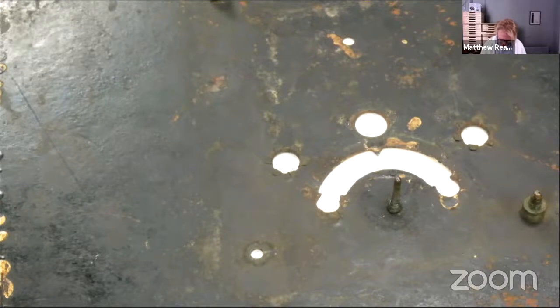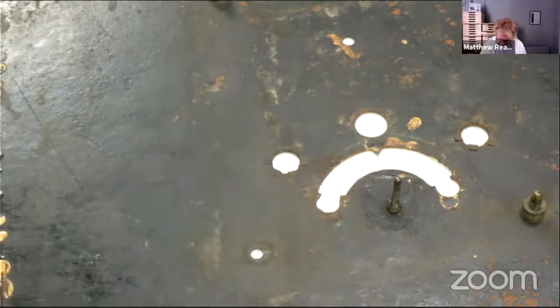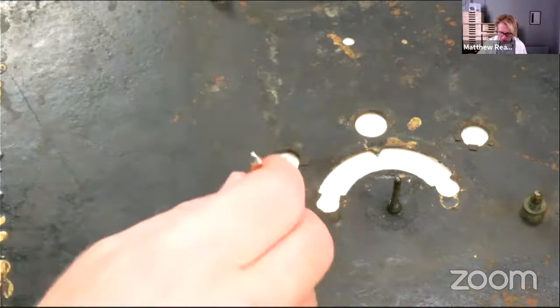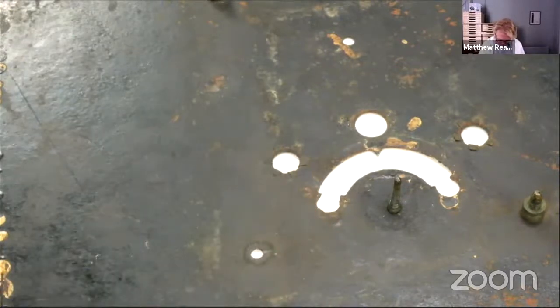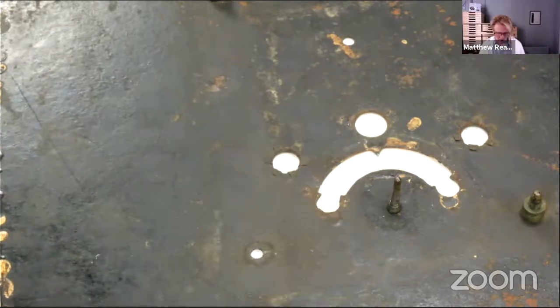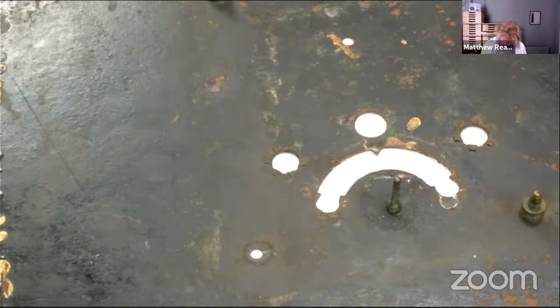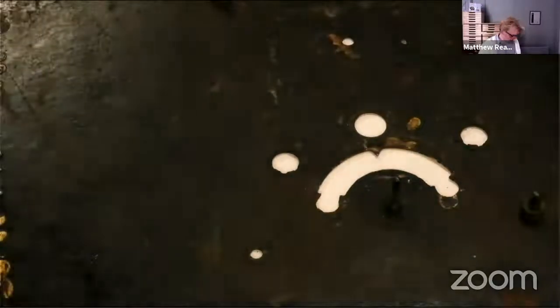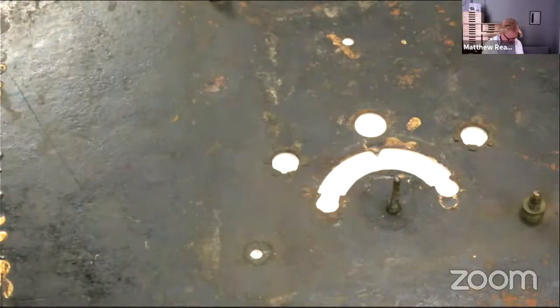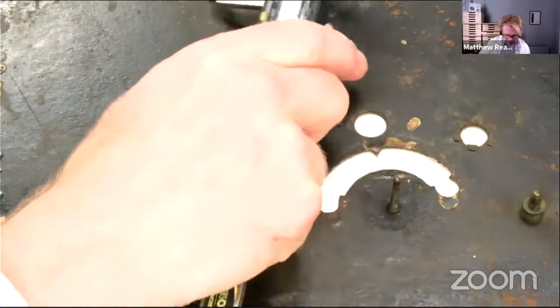You can actually buy the drill stock that these things were made from, which make a really useful set of gauges. And of course you can buy actual gauges as well, which occasionally crop up, but for this thing, just to gauge the size of the hole, so that's it. So the hole's about 4.6 millimeters diameter. So there we are. We've got a scruffy old drawing, which I'll turn into a better drawing at some point. So we need a bit of 10 millimeter diameter or thereabouts brass stock.